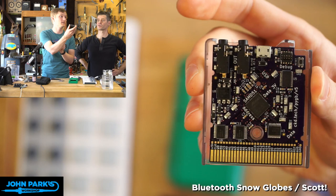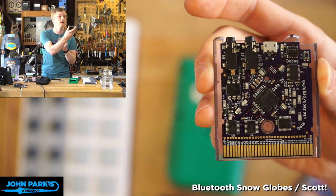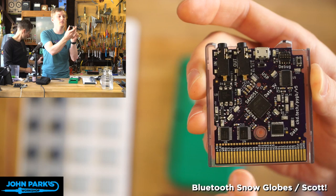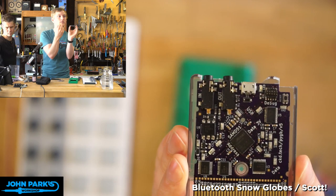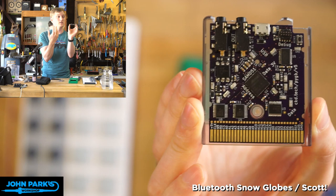We have 120 megahertz to decide what the Game Boy should do for us. The way it speaks to the Game Boy is through the cartridge connector — all of these are little wires that talk to the Game Boy. The Game Boy CPU is always fetching instructions — saying 'hey, what should I be doing next?' So what CircuitPython does in here is it allows you to just say, tell the Game Boy this set of things, and then you can do kind of whatever you want on the Game Boy itself.